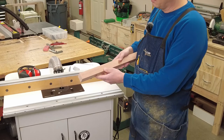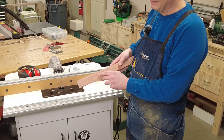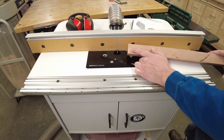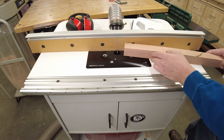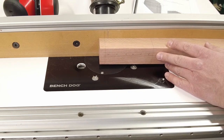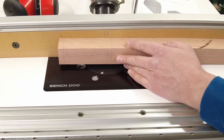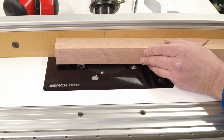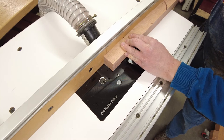I've marked on the workpiece — these X's represent where the mortise will be. The mortise will be three-eighths of an inch wide and three-quarters deep, offset from the face three-eighths of an inch. You line up your first reference mark with the reference mark on the left of the router table fence — that line corresponds with the left side of the router bit. You turn on the router, carefully line up your first line with the line on the fence, and plunge the piece down over the bit. Once it's all the way down, you gently push from right to left until your second mark lines up with the right side of the bit. Then you back it off and pull it up. I'll do this a quarter inch at a time for three passes.